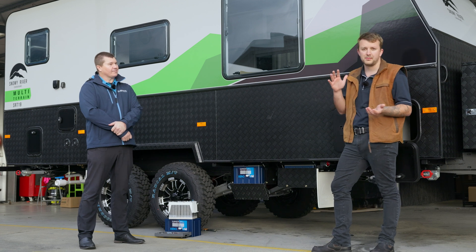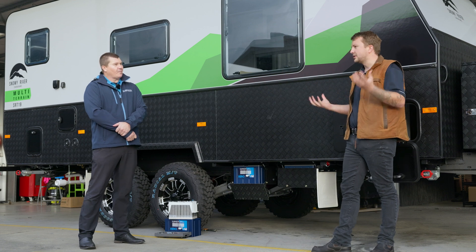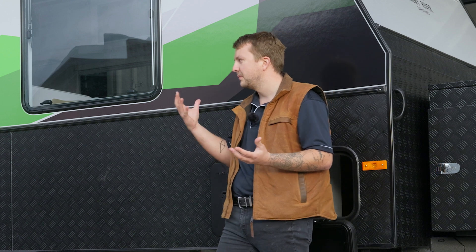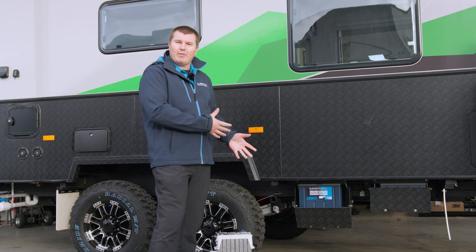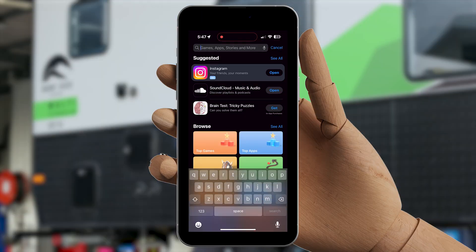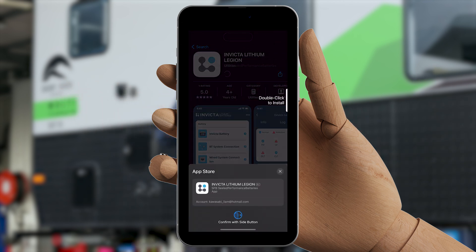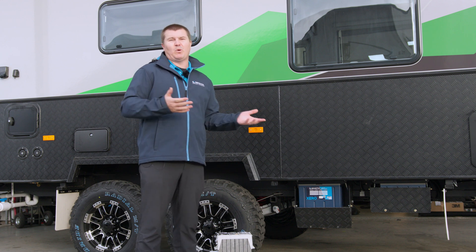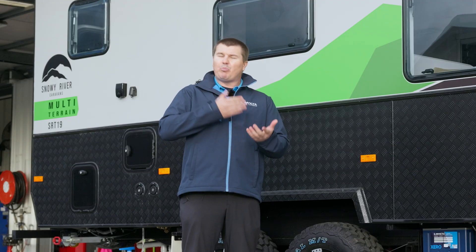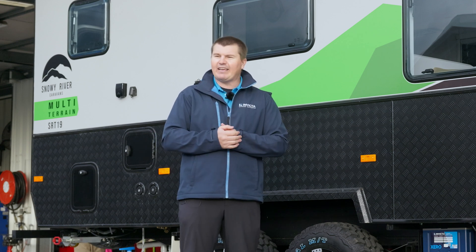Another one of the features these have, Sean, is Bluetooth monitoring as well. How do we achieve that when we've got numerous batteries? Historically with lithiums, if you put two 200s together, you have to monitor them individually on the app. How are these different? Because of this CAN bus communication, we can link the batteries together — they're all talking. So via the new Invicta Lithium Legion Bluetooth app, you can set the system up and monitor the entire bank as one unit. If you're running 16 of these in parallel, you'll see 1920 amp hours at 12 volts — all the discharge, charge capacities, everything at once. But you can also log into each battery individually to see cell balances and anything for troubleshooting down the track if needed.